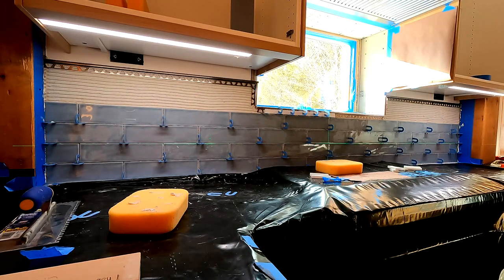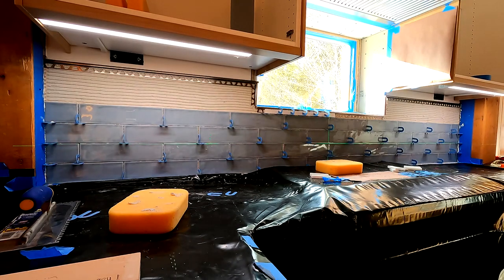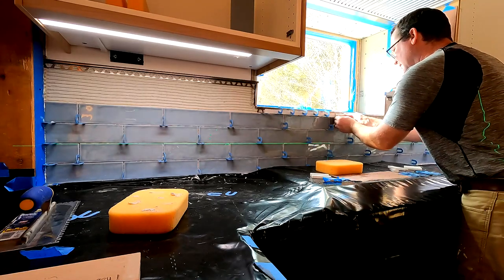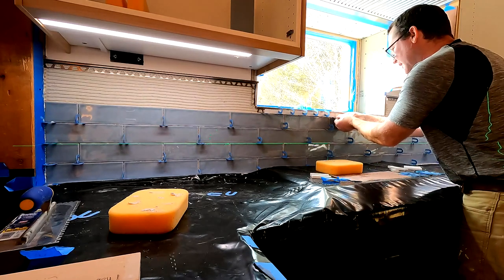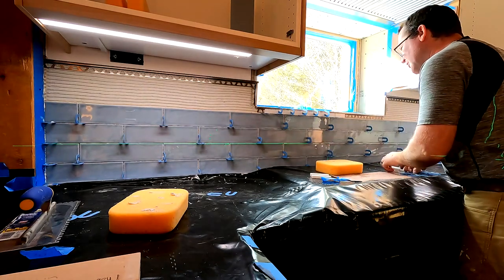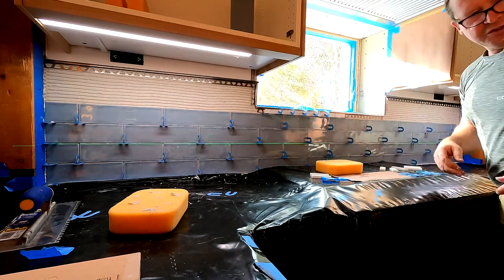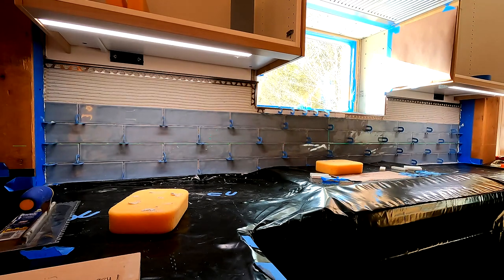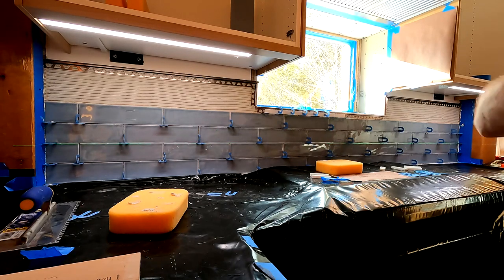Left. All right, so I'm putting in my decorative trim pieces, as I call them, and they're in here because, as you can see by the lineup of everything, I didn't want to cut one of these tiles, which are 3x12s, because this is basically an inch here. So everything else lined up just swimmingly. And I had a 1-inch gap because of this window drop.